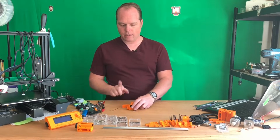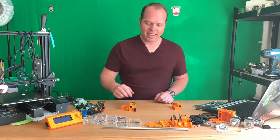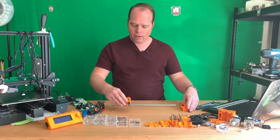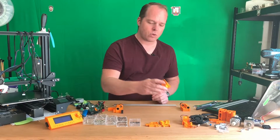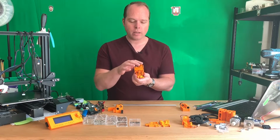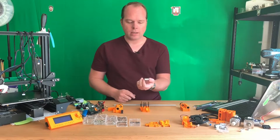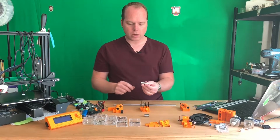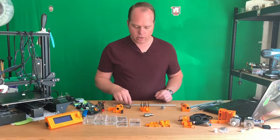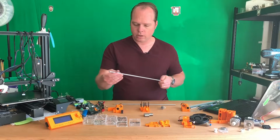So that is the motor end, the other end, and the two longest smooth rods. Well, we have those two ends and also the extruder gantry itself. Well, I already prepared it. I was using one normal linear bearing and one longer one. I don't know which kind of size this is, but it's the double size. Make sure that every linear bearing is running smoothly over the rod.